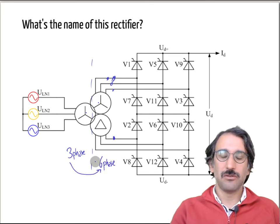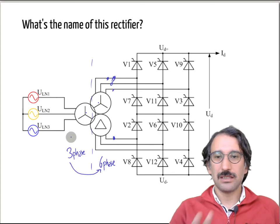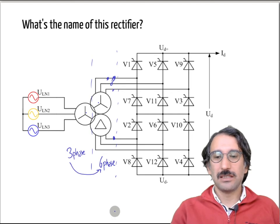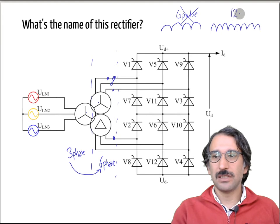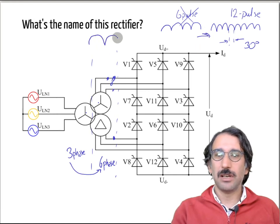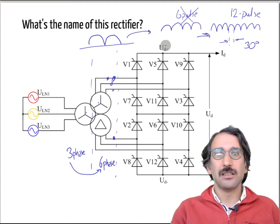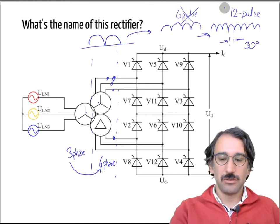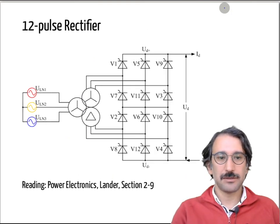This is basically a simple way to get a six-phase voltage from a three-phase grid. You are moving those phases so it is as if your converter is connected to a six-phase voltage source. If you look at the output, you will not see six pulses but instead much finer pulses — 12 pulses, each 30 degrees apart. Just as moving from single-phase to three-phase made the output smoother, here we go from six-pulse to 12-pulse.